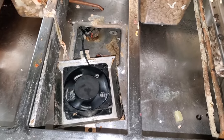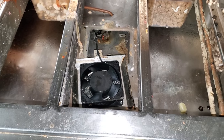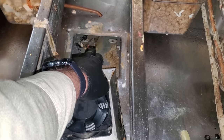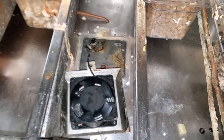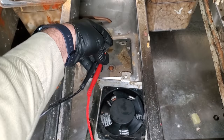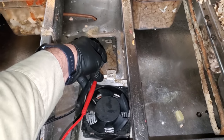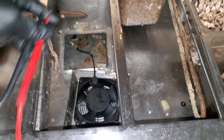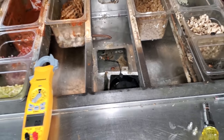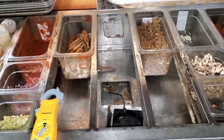Actually, I think it is locked up — you can tell by the way it's stopping. I'm going to have to open that up, but it has a horrible wire connection in there. Sometimes there's nothing you can do on these old ones. I unplugged the motor and we have 115 volts going to it. So we've got a bad fan motor, but I have a feeling there's more to it because this should be frosty and frozen up. We're going to change the fan motor first and then go from there.